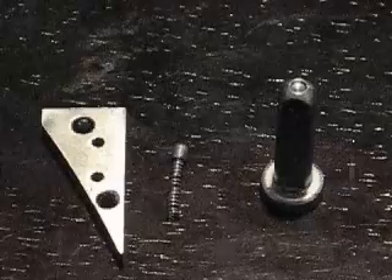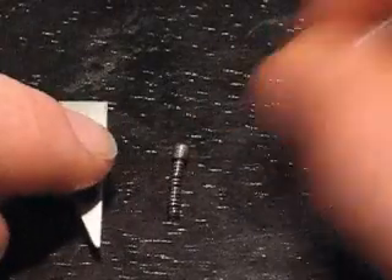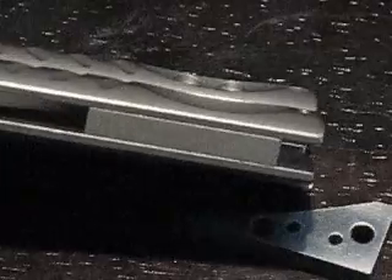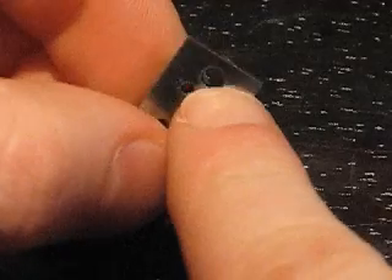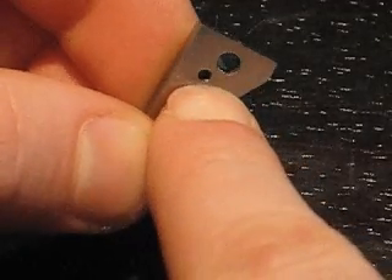Later I'll show you how they were actually machined. So first we'll start with the spacer. The spacer simply sits in between the two handle scales. There are four T6 screws, two on either side. You remove those and that piece will just slide out. You can see what I did is I drilled a hole through the center of this. It actually extends down below this hole that was already put into this piece by the manufacturer, to about this point right there.